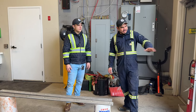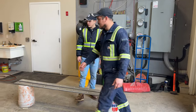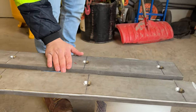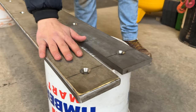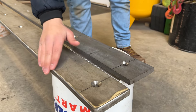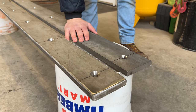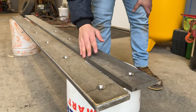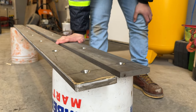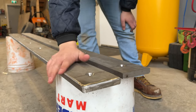Yeah, we're gonna take the old blade off the blower now, and then we're gonna proceed to put it on. Like you could see, eh? What a difference how smooth it is compared to how sharp the front cutting edge is here, you see? It takes about 10, 15 minutes to really smooth it out like this, but I can promise you it is certainly worth it, and it's very, very necessary. If you just put a brand new blade on like this, and you don't wear down and soften the front edge and the corners, you might run the risk of gouging quite a bit of driveways and leaving some scratch marks. So this softens everything up nice. That way the cutting edge could scrape along the driveway very smoothly.